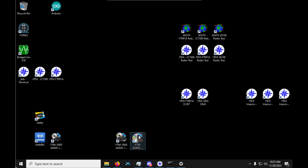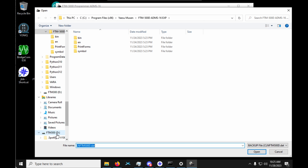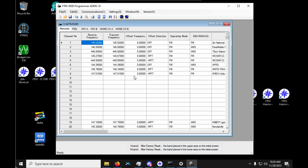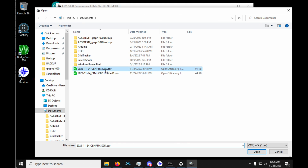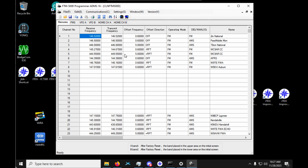Now that I've exported it, I'll close this and open up the FTM 500 software. I made a backup of the radio — even though it didn't have anything on it — because I need to be able to export that backup back out. To do that, I go open the backup from the SD card, navigate to my SD card, and here's the backup I made inside my car. I went to File → Import and imported my FTM 300 export. Once I did that, all of my channels that were saved on my FTM 300 are now part of my FTM 500 configuration.